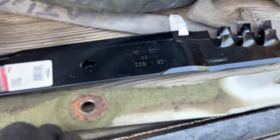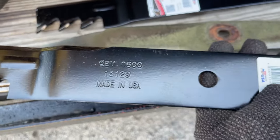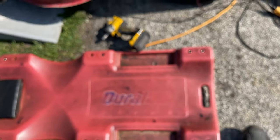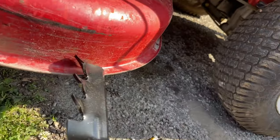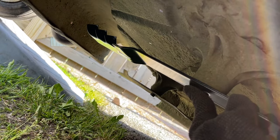Here's the old blade - notice the orientation of it. The curved part faces up. You can see the blade tip, the curvature part faces up, just like so. I'll angle it in the same direction the other blade is in to keep some symmetry going. Before we move them, you can give the blade a tug to see if there's some play in the spindle or shaft. If it sits firm on that shaft, the shaft is fine. That also gives you an indication if you may have a bigger problem than the blades.